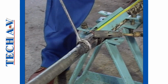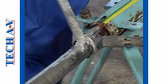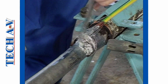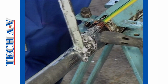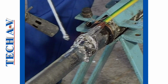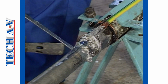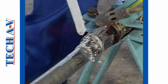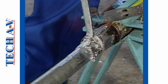We will demonstrate the stick wipe using a bar of S5 plumber's metal and a gas torch. First, warm the area to activate the tallow and tin the plumbing area by heating the lead sheath and stick. Then rub the area firmly with the end of the stick. Build up the thickness of the metal over the sheath and armors.